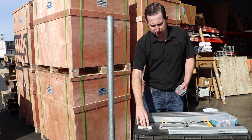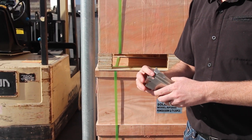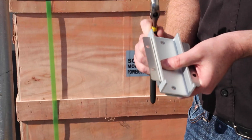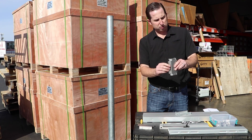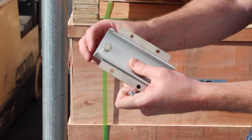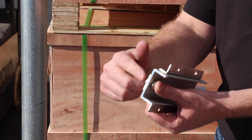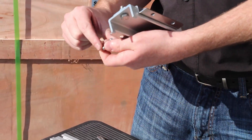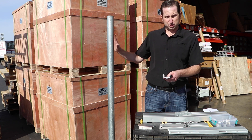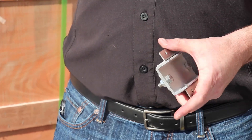Once we have that in place, we're going to start with our pole bracket and our pole clamps. These fit together one inside the other — they can be a little tight to get going, but they will fit. Sometimes you just need a little tap to get the holes to line up. Once those are together, we're going to start with our 5/16-inch bolt, placing the bolt head from the inside to the outside, then attaching our 5/16-inch flange nut. Do that with both holes. This is the two panel mount — it's very similar for the four panel mount, just with slightly larger brackets and nuts and bolts, but all the steps are basically the same.